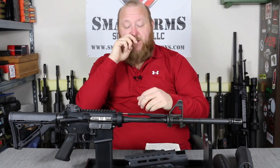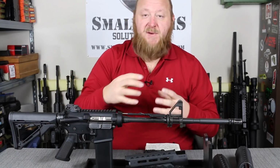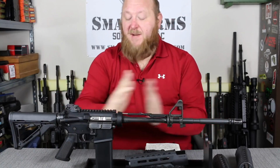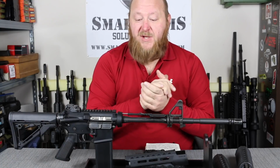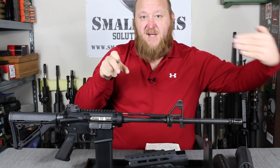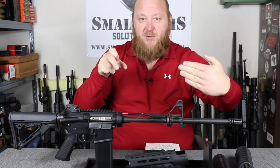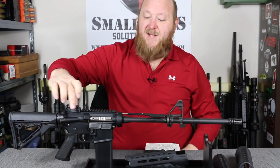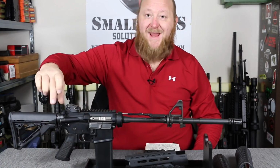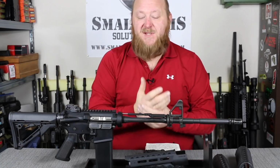One of the biggest things that separates the two of them is the bolt carrier is free in here. It's free floating in here. It's designed to go straight back. If you look at any external piston gun, AK or whatnot, you'll see that the bolt carrier, because it has the offset hit for the piston, which would drive a carrier downward, rides inside of rails to keep everything straight and in line, which this does not have. So you want something that's designed that way.